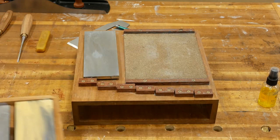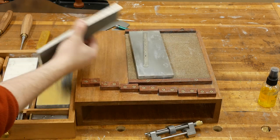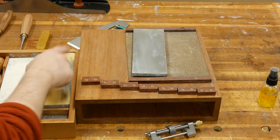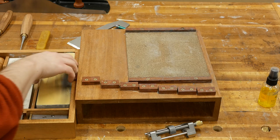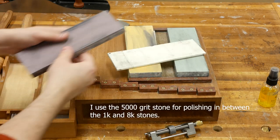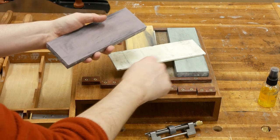This is the sharpening station — this is where I keep all of my supplies. To flatten the backs on both the plane iron and the chisel, I've got a coarse DMT diamond plate that's going to do all of your rough work. We're also going to use it to flatten your water stones. I've got a 1000 and an 8000, but when it comes time to flatten the back of the chisels, I do have a third stone — a 5000 grit. Since we're polishing such a large surface, we need something that goes in between the 1000 and the 8000.